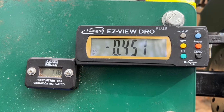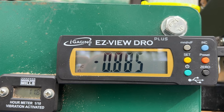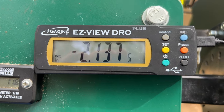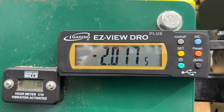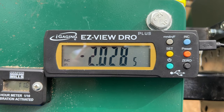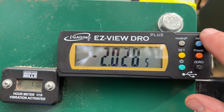Going down - seven, nine - so that's way over shot. Let's go back up. Now I'm at six tenths - seven, eight, nine - so that's probably where I'd want to be. Let's do a two inch cut - one point nine, two point one. With a little finagling and being fast on the switch, you can get it to within 30 to 60 thousandths, which is what you want - a sixteenth of an inch allowance for the blade.